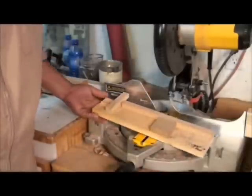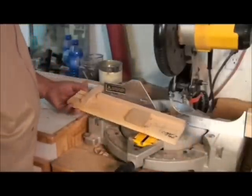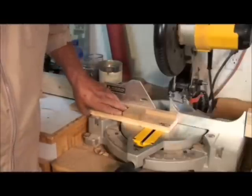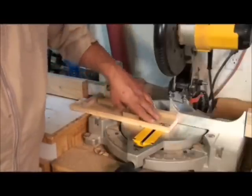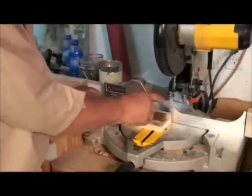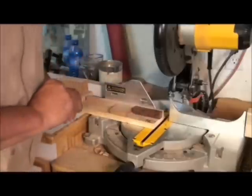This is another jig I've got for different pen blank sizes. I put this back here, clamp it in a certain position with my hands far away from the pen blank, and I can trim those up. I've got marks on there where I can cut them in half or cut the ends, and do it safely.